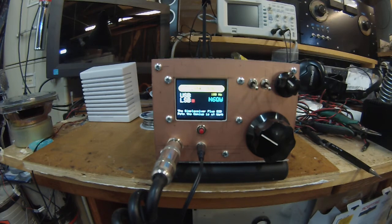Well, this is a total design — my own design. I've used a few bits and pieces I've picked up in places, but it's not a kit, and it's not somebody else's project that I just built. It's using some interesting technology: there are six J310 JFETs. Two apiece are configured as dual-gate MOSFETs. The receiver RF amplifier is also the transmit pre-mixer and pre-driver, and it uses a pair of them. The IF amplifier stage has a pair on either side of a commercial 9 MHz filter. The driver stage uses a 2N3904 with a BD139, and that's driving an IRF510. I have a blog at www.n6qw.blogspot.com.